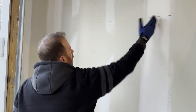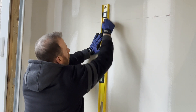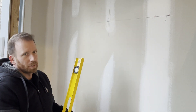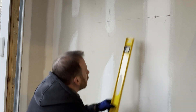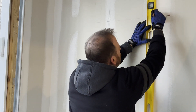So if I know I want it right here, I have to get one board in here and then 16 inches over. What I'm doing here — because obviously I'm going to end up covering the line with the piece of wood going up — I'm drawing a plumb line. That means where my bubble is between these two lines, it's perfectly straight up and down, which means I can see where my stud is going to be. I can pull over, put it right on 16, make a mark, and do the same thing to find my plumb line. Right there — that's where I'm going to secure it.